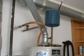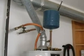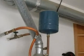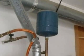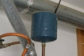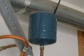One final detail. In most circumstances, if you see a water pressure reducer in the system, then you have what's called a closed system. Look for a thermal expansion tank for the water heater — it usually looks like the small tank at the top of the water heater. If you know that you have a pressure reducer in the system but you don't see a thermal expansion tank, then talk to a plumber.